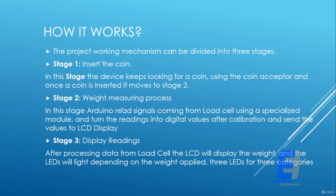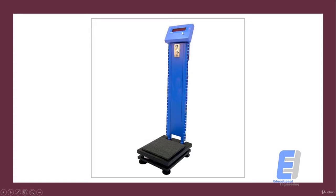This simple device is a coin-operated weight measuring machine. As you can see, this example uses a seven-segment display, which we will replace with an LCD display for faster reading and processing, though we can also add the seven-segment connection. Here is the coin acceptor — you place the coin here to initiate the reading. This black box is where the load cell lies underneath, so when a user stands on this area, the load cell reads the weight via the module, Arduino processes it, and displays it on the screen.